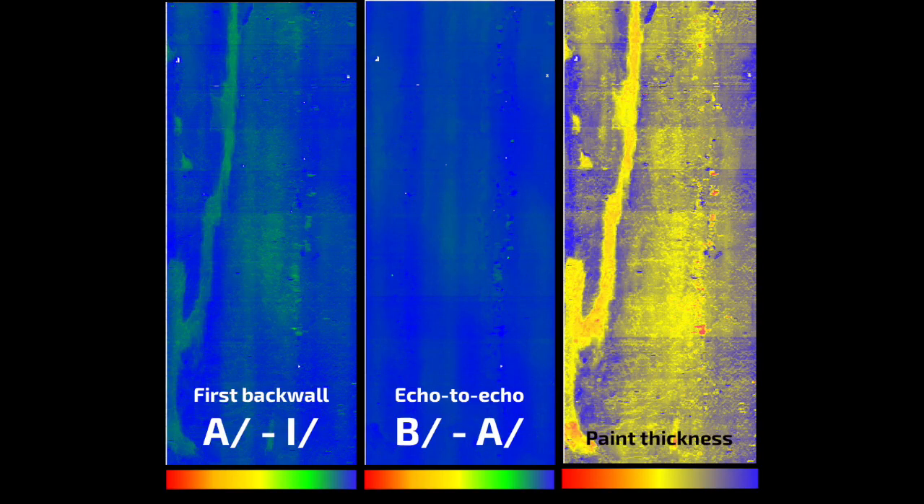That isn't always the case. If you take a look at this hydroform scan, you'll see on the right-hand side the coating varies quite a bit, so you just have to be careful. Whatever you do, make sure you follow your procedure and write down what you did. If you used echo-to-echo on your readings, write that in the report. There's a lot more we could talk about for thickness testing and the echo-to-echo technique, but I'll save that for later videos. I hope you found that useful — thanks for watching.